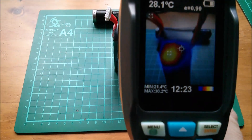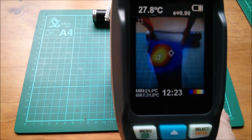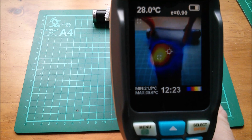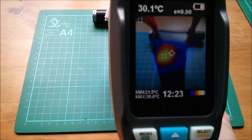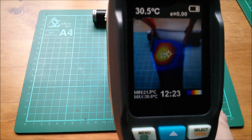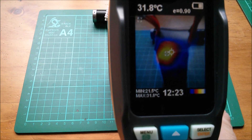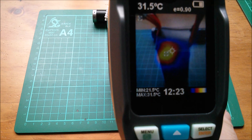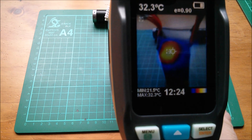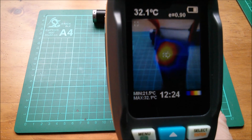It is generating heat, so it's presumably using resistors across those cells. They're quite small — it's not generating a lot of heat. They're not low resistance enough to be used for balance charging because it wouldn't happen quickly enough. But they are being used to put this battery into a storage voltage state.